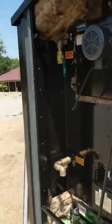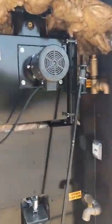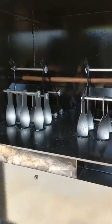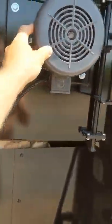If you come around to the back, this is where this furnace in my opinion stands alone from the rest. You have a very heavy-duty combustion fan here, and a very easy open load access door. Here's the heat exchange area where the tubes are — you've got 24 heat exchanger tubes, most in the industry, for lots of heat transfer. Giant fan motor that weighs probably at least 20 pounds — this is not your everyday Dayton fan.